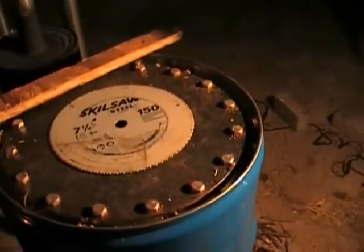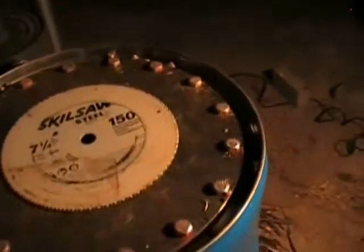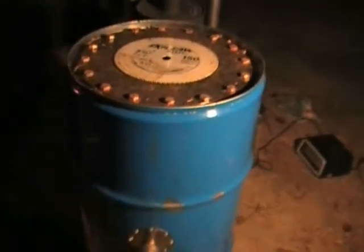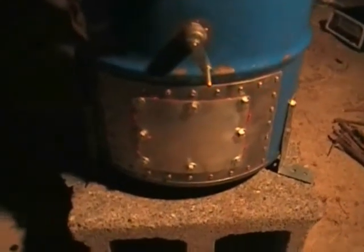On the top of this unit I've got a quarter-inch thick steel plate that my fire tube is welded to. Everything is bolted down and everything has high-temperature RTV cement on it. That's one thing you've got to be extremely careful with — as long as you keep any oxygen that's not supposed to be getting in from where it shouldn't be, you'll be safe. If you have any leakage, you have a chance of a flashback or a small explosion. It's not going to blow up like a bomb, but you wouldn't want to be over it and have coals blow up in your face.